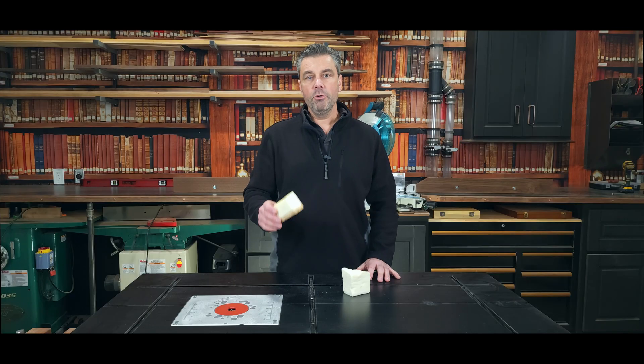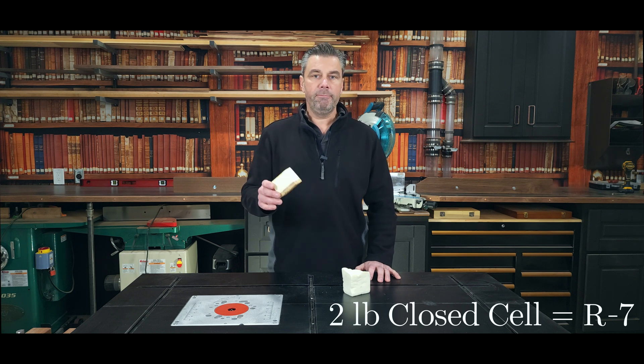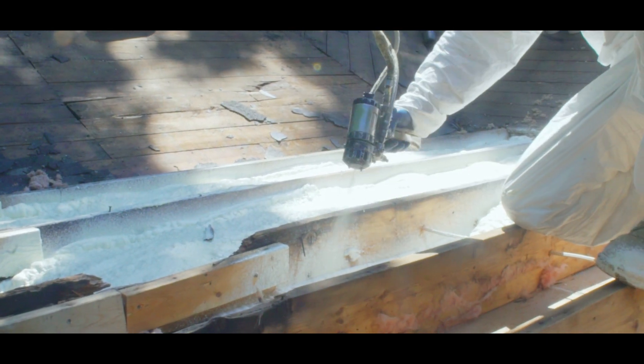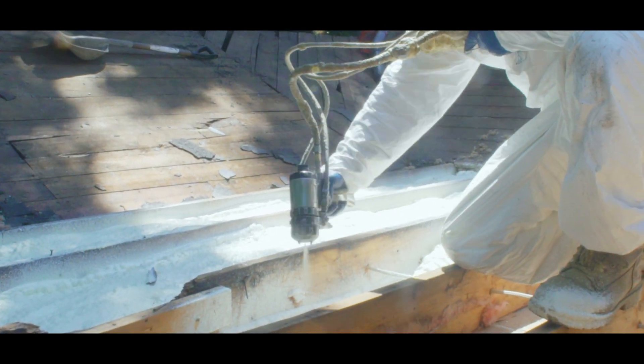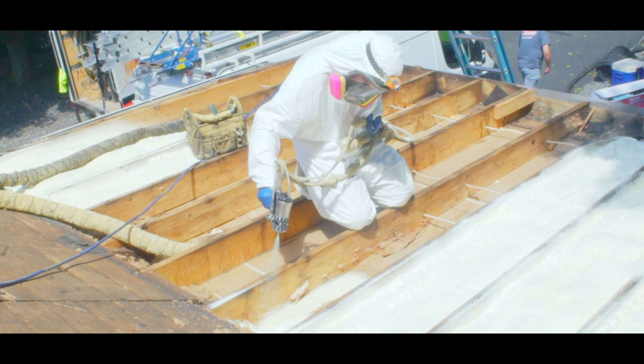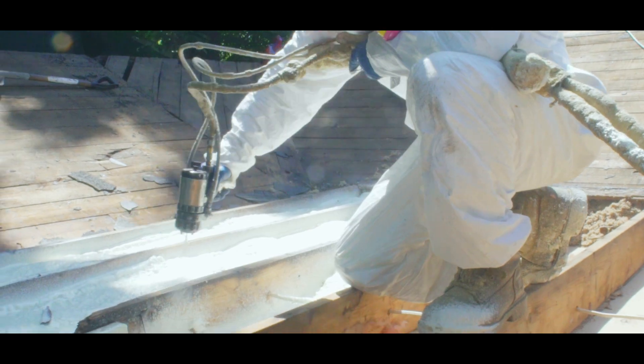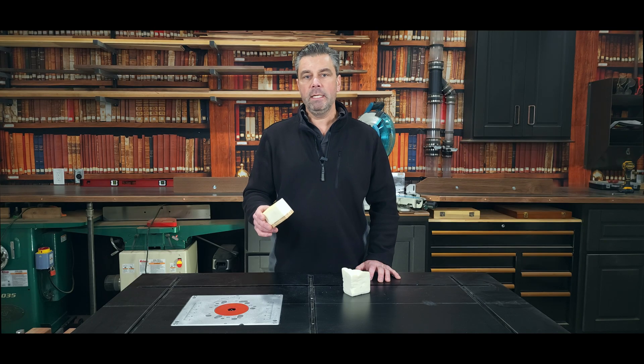When we look at a two pound closed cell, not only are we receiving a full air barrier at that two inch mark, but we're also getting an R seven to seven and a half per inch or so. Depending on the foam, that's going to determine exactly what you gain — most foams are usually going to end up with an R seven. So out of two inches you're going to end up with an R 14, and in some instances you may need to go to three inches to meet your specs. This is the much better option for exterior walls, attic spaces, and definitely for crawl spaces and basements.